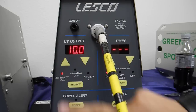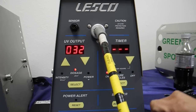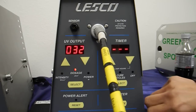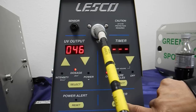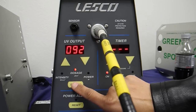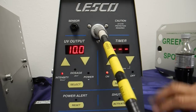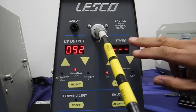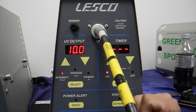I'll switch this to dosage. Again, this is the previous value — once I open the shutter activate, it will go down to zero and count up to whatever accumulated energy has been generated. I'm going to open it and let it run up to 100 joules per centimeter squared. That came to 92, so the time would have been approximately 92 divided by 10 watts per centimeter squared — something like 9.2 seconds. The computer in this board is simply measuring the exposure time multiplied by the preset intensity. That's all it is — a dosage monitor. It has really no active part in controlling the amount of energy you're dispensing.